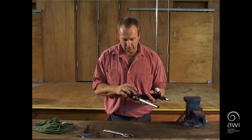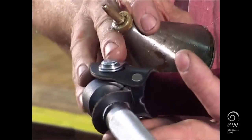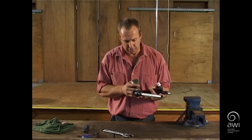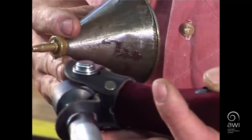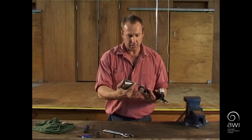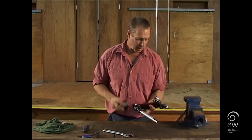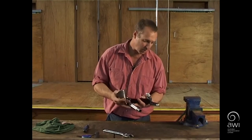Now, on the spring, the grease caps here should be greased once a month. And going back to the grease nipple or grease point at the back end, it should be greased once every week. The rest of the handpiece, the cogs and the ferrule, should be done every cutter or comb change, the start of every run. The ball on the ball race should be done every comb and cutter, or the start of every run.